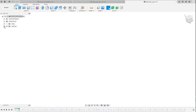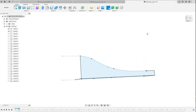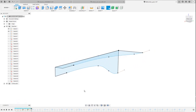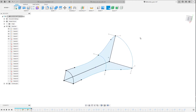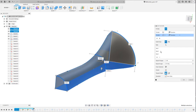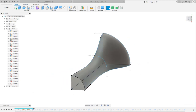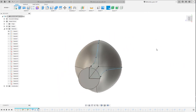I'm gonna show you the first two sketches — I'll open up the sketch folder so you can see I drew one on the top plane and another on the front plane, followed by three additional sketch lines. These sketch lines help me define and control the forms in the Loft command that comes next. I used the first two sketches as my profiles and the additional three sketch entities as my rails to turn this structure into a pretty complex form without losing any control. Then I used the Mirror command twice to turn this into a full 360-degree body.